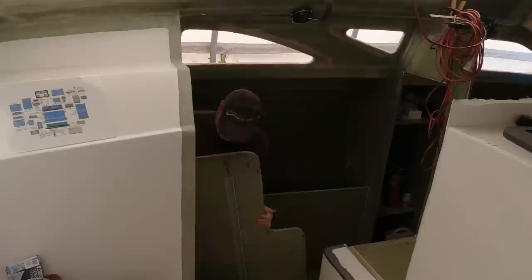I don't need anything else other than perhaps a drain — either into the bilge or perhaps into my blackwater tank, since the tank is directly below it. I'd rather drain into the blackwater tank. I really don't want condensation drains going into the bilge because that means I'll have a wet bilge, and I really don't want that at all. I know we're going to get some water in there but I want to know it's coming from the ocean, not from the evaporating compressor or freezer. I'd rather have dry bilges and have all that water go into the blackwater tank where I can see the level rise and just pump it out.